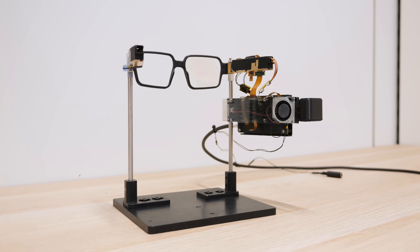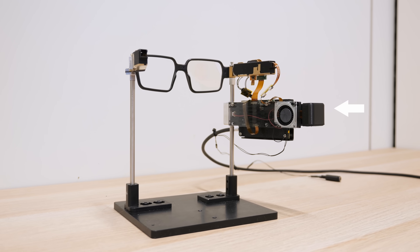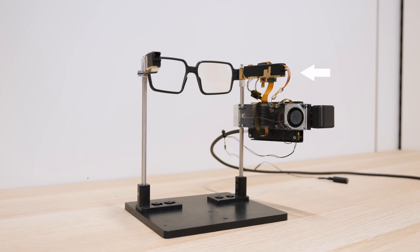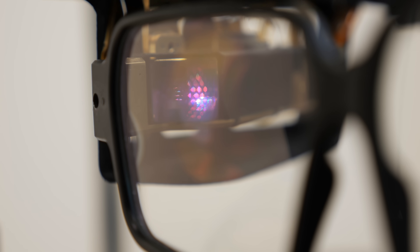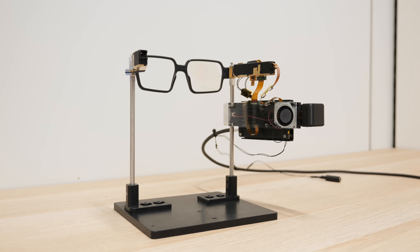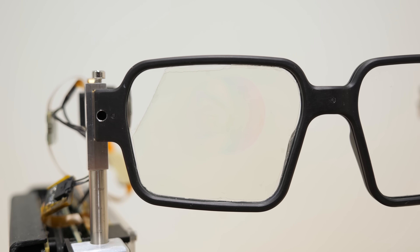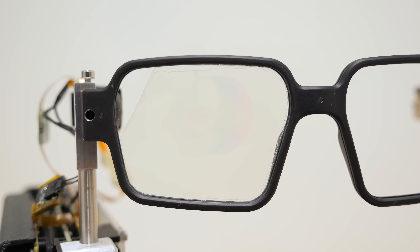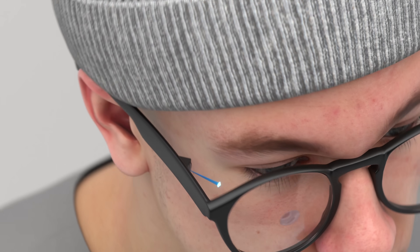This version shows us what just the display and related bits look like today, and it consists of three main parts. First, a display driver, which we'll come back to later. Second, and more importantly, there's a projector in the stem of the glasses — this projects an image onto the lens, and if you look from the correct angle from the front, you can even briefly see a little bit of light being projected from the stem. Third, on the lens itself is a holographic film. On this prototype you can see they're applying these as stickers, and the little circle on top is the holographic part — a special mirror that reflects the projections back into your eye. The image gets projected from the stem onto the lens, then bounced back into your eye.